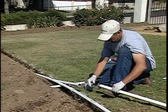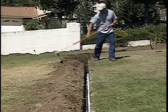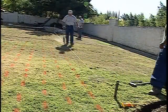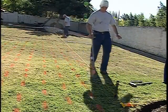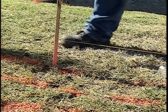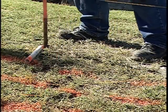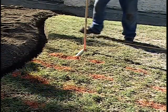The supply line is assembled in the usual fashion and the trench is filled. Next, the lateral lines are marked. A well-designed drip line system will create an even wetting pattern. A 12-inch section of pipe is used to evenly space the guideline, then the lines are marked with paint.